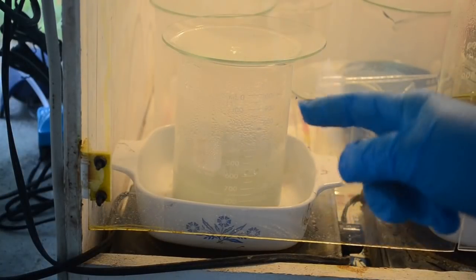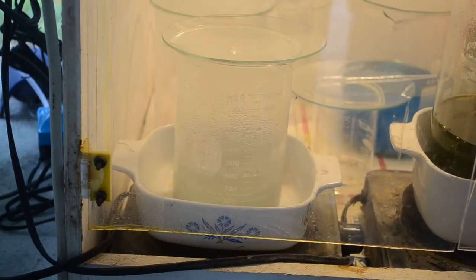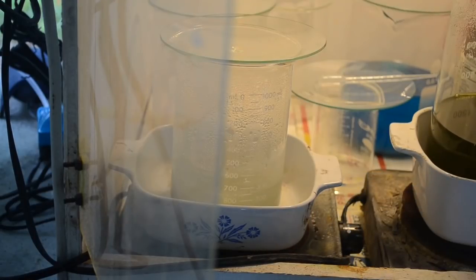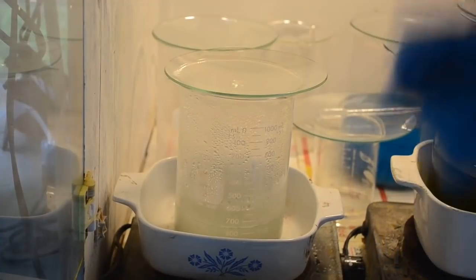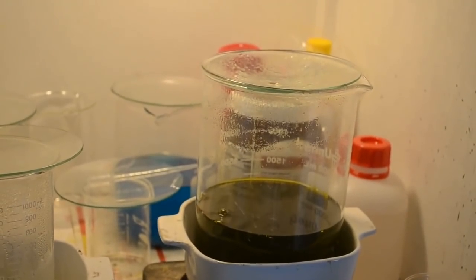Okay, my strategy with this isn't working. Yeah, the boiling gets some of the silver chloride suspended in the water, but as I pour it off, I can see that I'm only getting a tiny fraction of it out, and I'm dragging some gold over too when I pour it out. So I poured it all back into this beaker, and I'm just going to stop with the boiling. It's just not working. And I'll let this cool down. What I'll do is my second idea, which is when I get the gold from this solution, I'll add it to this beaker with this mess and redissolve everything in aqua regia and filter it really well to get rid of that silver chloride mess. Okay, so that's my new plan.